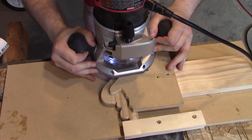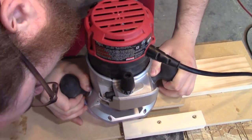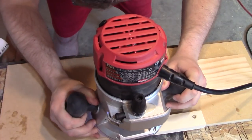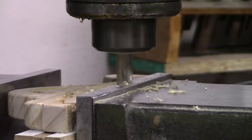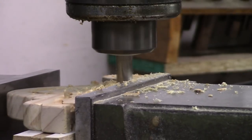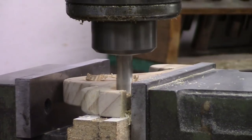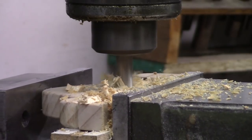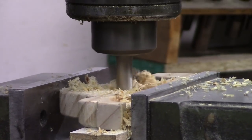To cut out the recesses in the flanges — you can see on the 3D art there's clearly a recessed area where the red ends up being — I made a little template for a router and routed out the basic outline to get the shape that I wanted. After that, it was back on the milling machine. We do not have a CNC mill set up yet, so this was all done freehand. Went into the vise and milled out all the meat out of those recesses. This took quite a while. There's probably a lot better way to do this, but it worked out okay in the end.